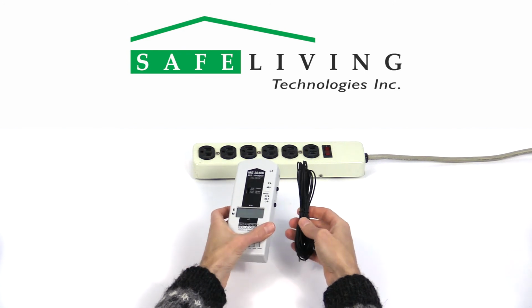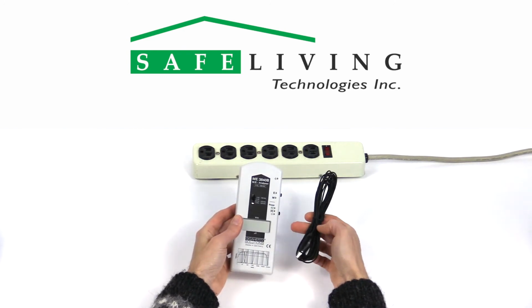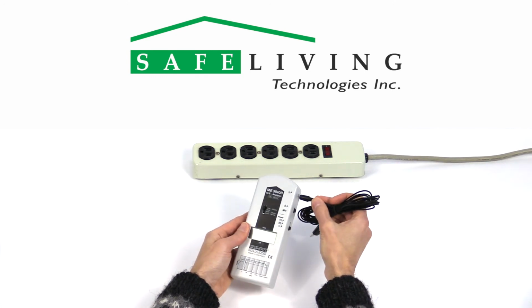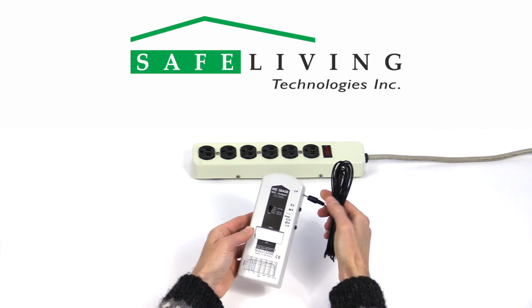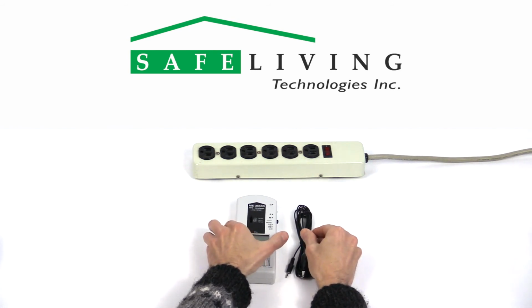Electric fields can be measured referenced to ground or ungrounded, potential-free. For best results, ground the meter by connecting the included 17-foot cable to a copper water pipe or to an electrical outlet using a grounding plug. For more advanced information on grounding procedures and advanced measuring tips for electric fields, please watch our Advanced Electric Field Measurement video.